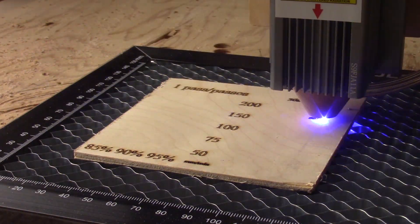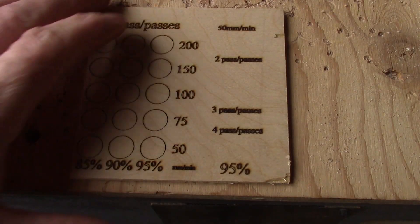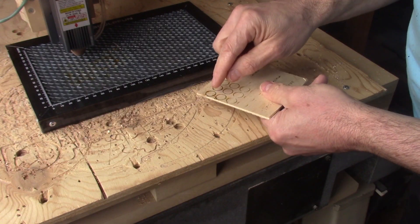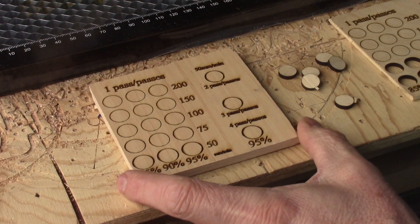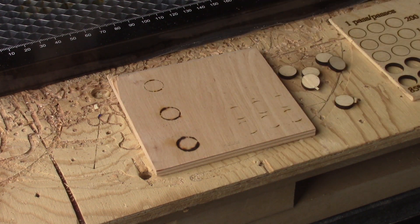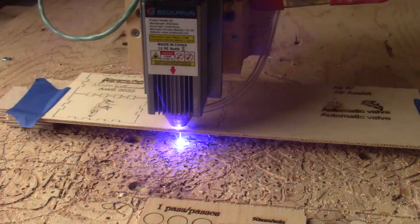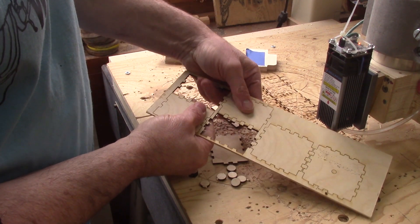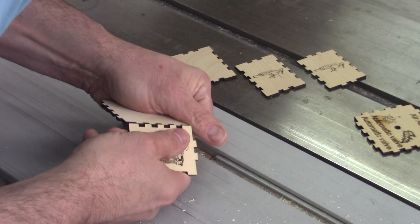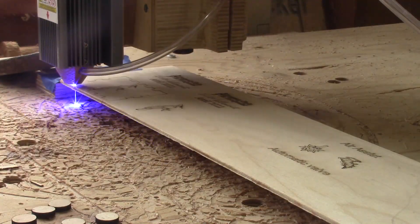Now I need to try this. The first thing I do is cut a test with different speeds and power levels in 3mm plywood. This is the result — it's special to be able to free the pieces like that. I do the same test but this time with a 6mm piece. I can see it's possible to cut through this plywood, but the back is pretty much burned. I don't think I will do this often. Now it's time to try it for something more useful — I will cut a small box for the circuit that opens the air valve. I think I will always be amazed at how easy this can be separated. The cut is perfect but I can't put the box together, so I make another one with more space between the fingers.